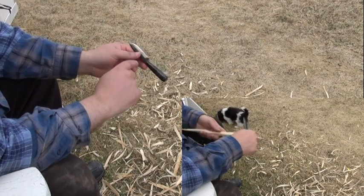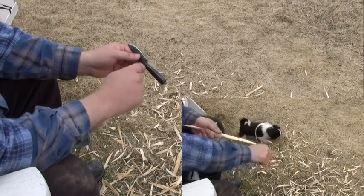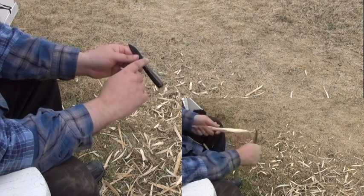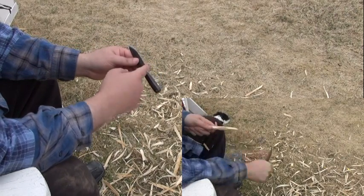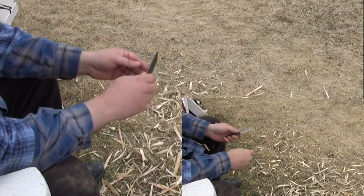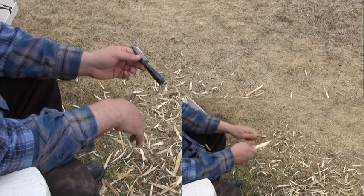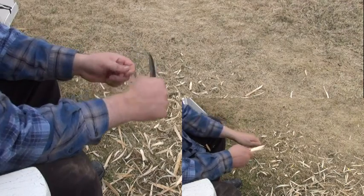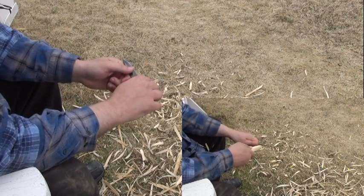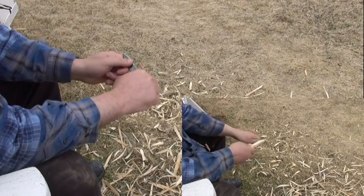Something I was curious about: Kali Harris, Fred Perrin, and a number of other people use dramatically different widths at the blade-to-handle transition versus the handle itself. That can give you a drop blade profile — a sort of pseudo guard — which is nice because it lets you work closer to a cutting board and gives some security for penetration stabs. But I found you can't really maintain a hammer grip in it — the blade is too narrow and I'm not making contact at all with my index finger, so you can't get the power.